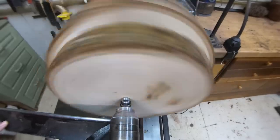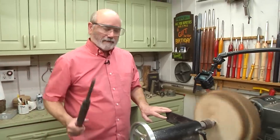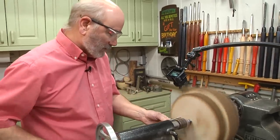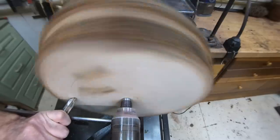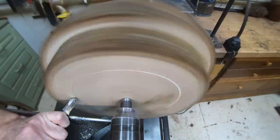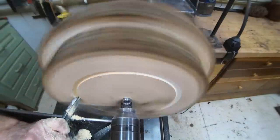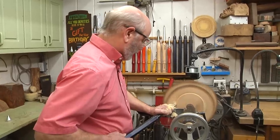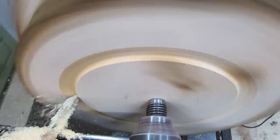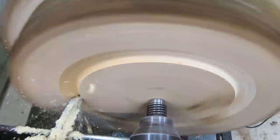There's the wobble — I can go a little past that and see, it's straightened out right there. I am at about 340 RPM right now. So we're going to come in, and this is just like hollowing a bowl out, but I have a tailstock in the way. So we'll just have to try a different approach, come in this way, take light cuts, and we're not going to take a lot of wood out at a time. At this slow speed, I just have to let the tool feed itself. Our goal is to hollow out the two top pieces and maybe a little bit of the bottom piece to give us that bowl shape.